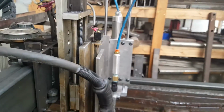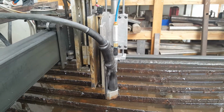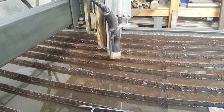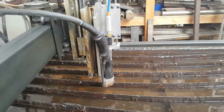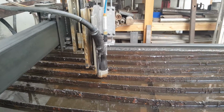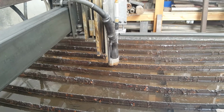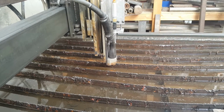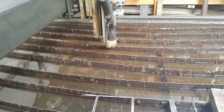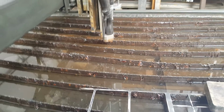But now that I have that spring in there, I really don't need the cut height, because I think I'm at full pressure right now. That's another reason I had to go to that spring, or a floating head type thing. When I was playing with the pressure, getting it down to 10 pounds or maybe less, it wanted to retract, so you have to push that air back through there, and I had it down low enough that it didn't want to raise all the way up, or if it did, it went really slow. So that solved that problem also.